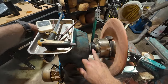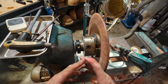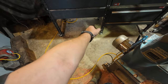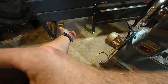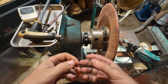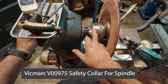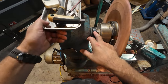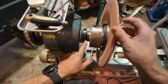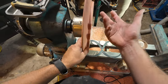I put this on before I started sanding because I've had enough things going pear-shaped at the lathe. The other week I had a bowl explode — smashed up into my arm and all this was really badly bruised. So I'm just taking all the precautions and forming some really good practices back into my turning. This here will stop your chuck from coming off the lathe. They come on VL240s — on the handwheel — you put it on with two Allen key screws, and that'll stop your chuck from winding itself off when you're spinning it in reverse when sanding.